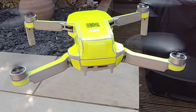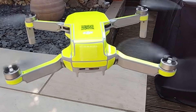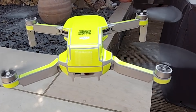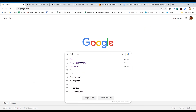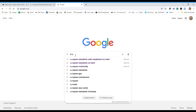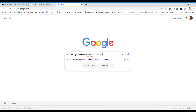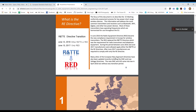In this case it's radio equipment that meets power and frequency limits for those regions in order to avoid things like interference. In the US we have the Federal Communications Commission, the FCC, and in Europe we have CE — the European Conformity System — and both of these are responsible for regulating radio equipment specifications and management.